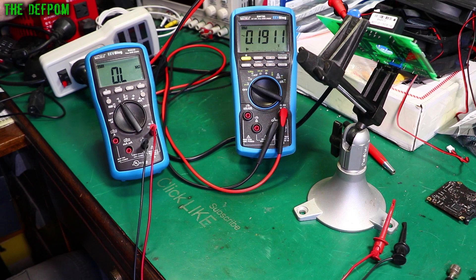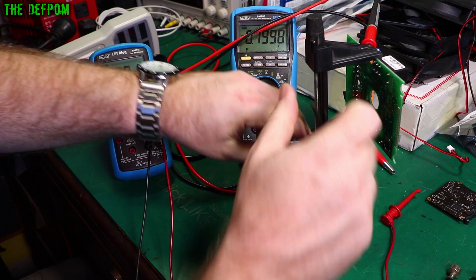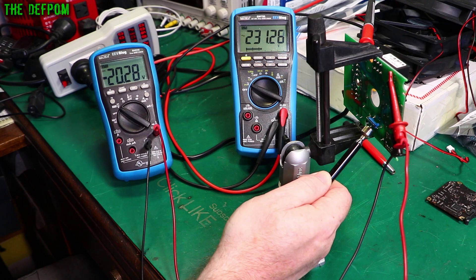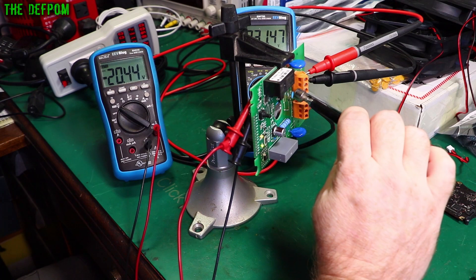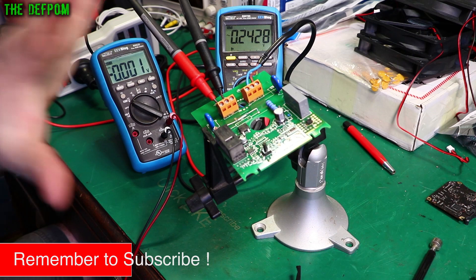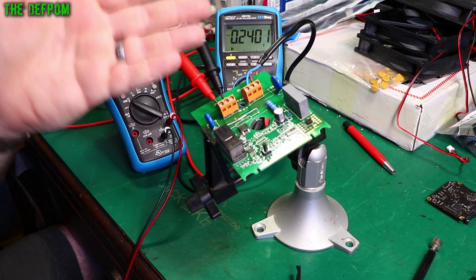Okay, let's try this — 19 volts. Let's try this reed switch here. That's not changing. The other reed switch — that's not switching either. So the voltage to the relay is not switching off when I activate either reed switch. The switches are definitely switching, but nothing changes. Maybe it needs both in a specific combination — one on, one off, or both on, both off. Maybe one is low pressure and one is high pressure. So maybe one is which turns it on and off. My next thought is the switching transistor.